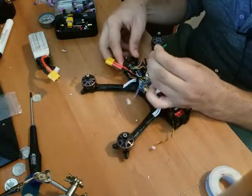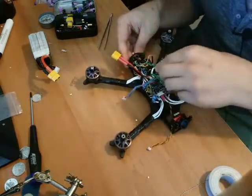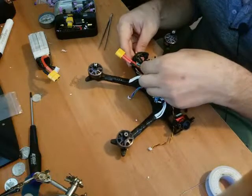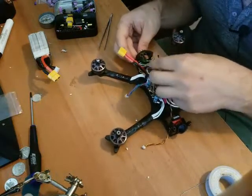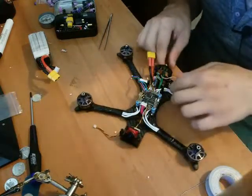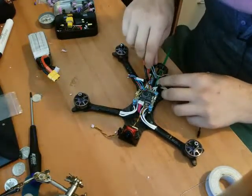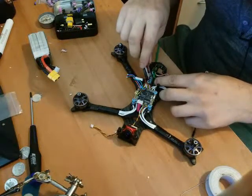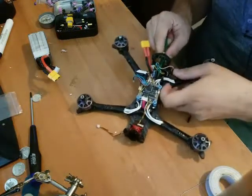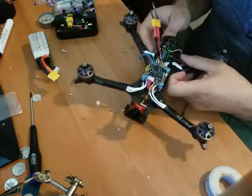I'm going to bring it up until the rim is just under the back of the quad. I send it up over top of the wires on the RX. Back in there. That's satisfying, the zap strap sound. Before I tighten it, make sure everything's positioned well and the wires are all tucked under the zap strap. They need to be under it, just to keep them tidy and out of the way. As tidy as it gets on a jank build. And that's good. That's happy.